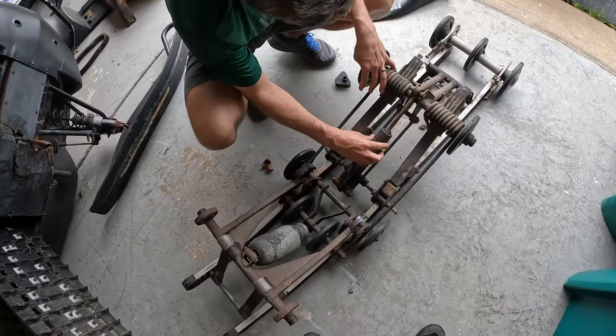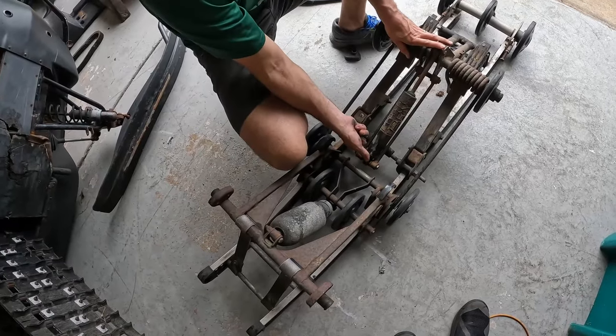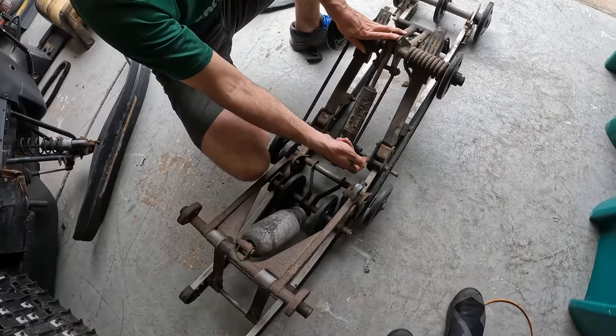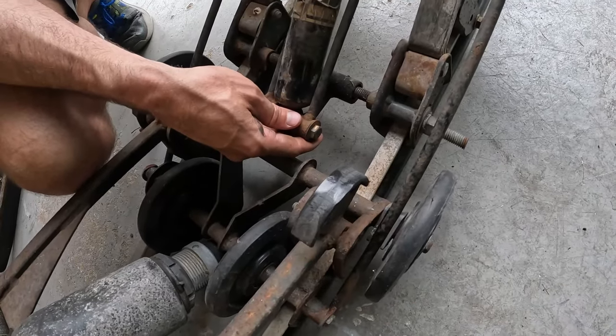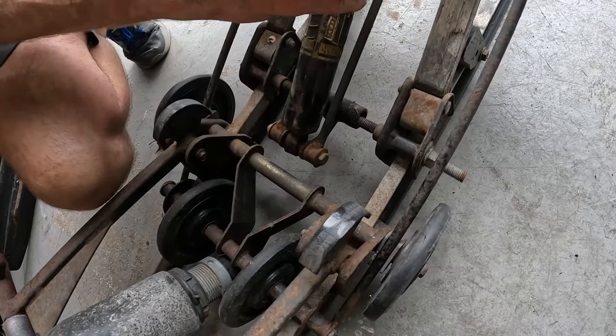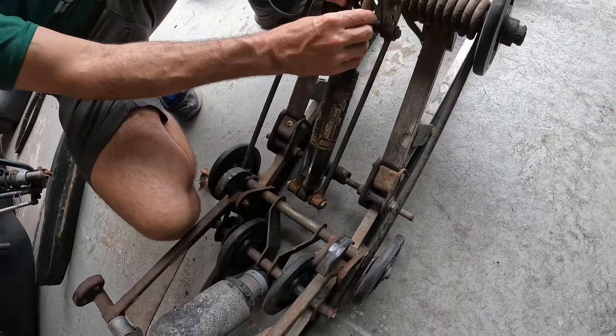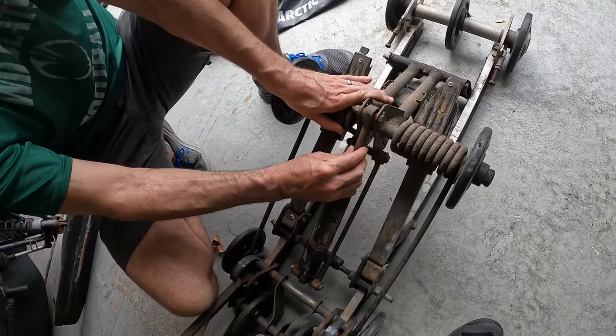So here's the other thing. It's a little concerning. This is why it was squeaking so bad. Obviously it's loose here because it's the wrong size. Should be a pretty well-fitted shaft in there. And that's missing. Okay, so that's problem number one. Problem number two is there's supposed to be a rubber grommet on this, and that's completely gone. And so now you've got all that play.